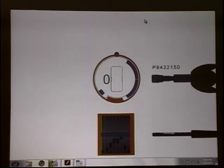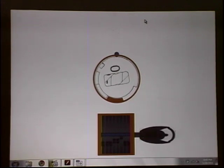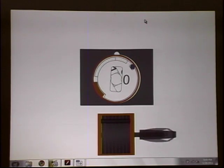Where the gates are around the disc determines what those numbers are that are stamped on them. The different angles on the key, as it begins to turn, will rotate the gates in cut depth order. When it comes fully around, the gates line up with the zero disc and the profile disc. The only difference between the profile disc and the zero disc is that the profile disc has a small bit in the middle to keep you from putting different profile keys in. The whole system can then turn.